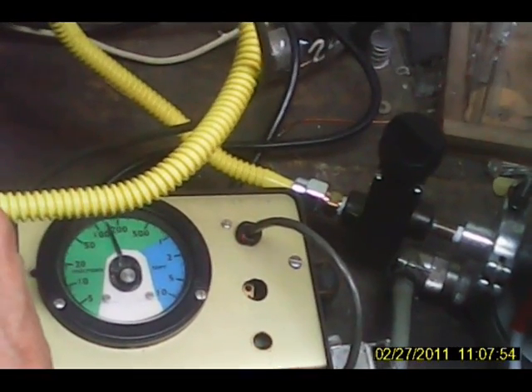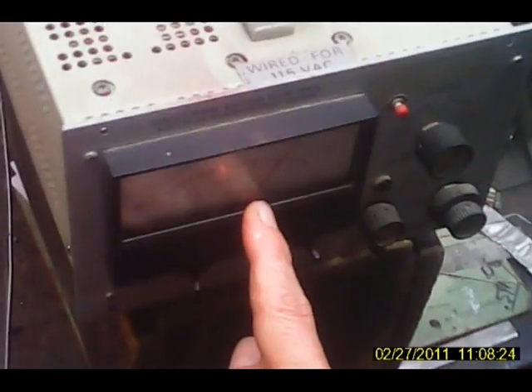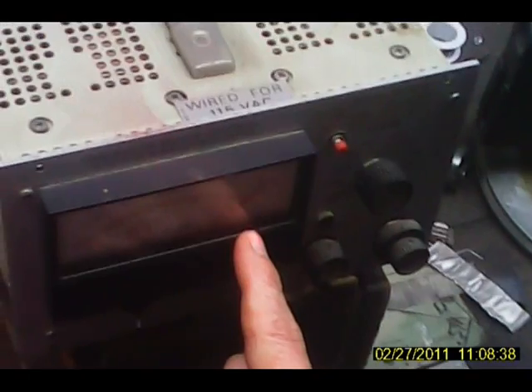Let's go up a little bit more. There's 200 microns. It is definitely affecting the pumping ratio — we're at about 6×10⁻⁶ to 7, bouncing between 7 and 8. That's with 200 microns of backing pressure. We're almost about to bounce up to 10⁻⁵ Torr. It's pretty clear that to get into the 10⁻⁶ Torr region we need a backing pressure below 100 microns.